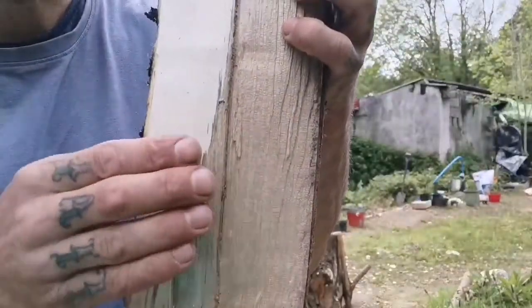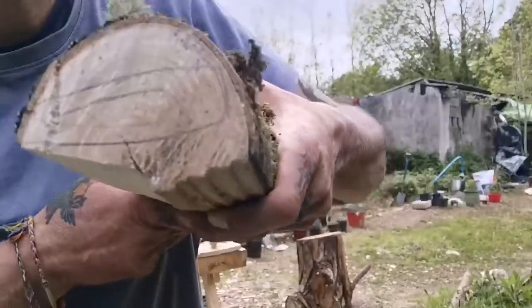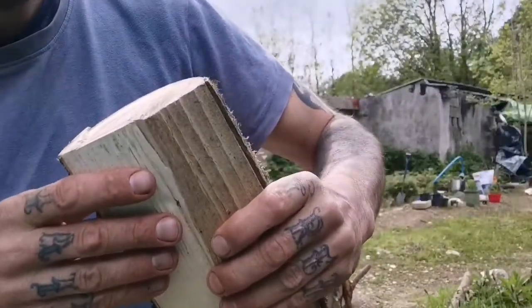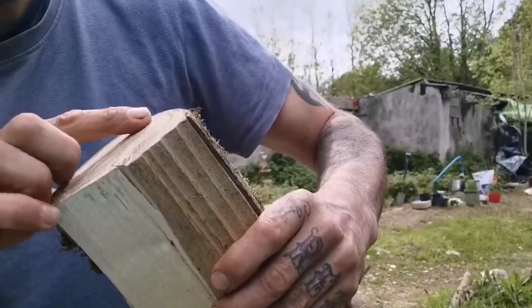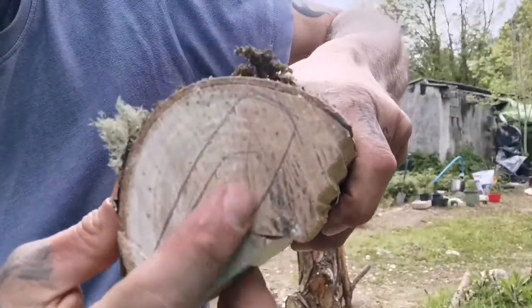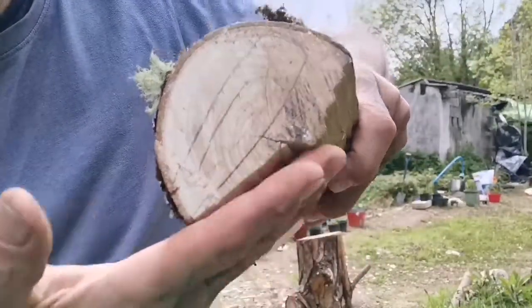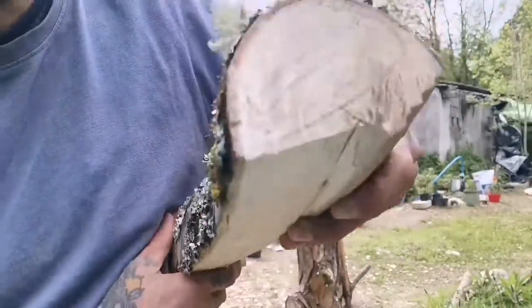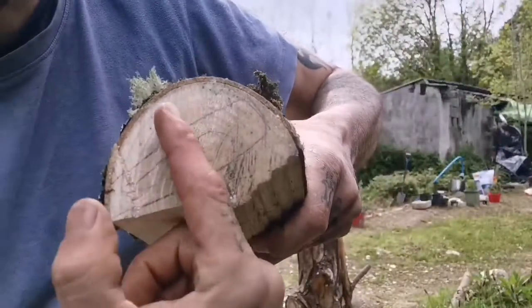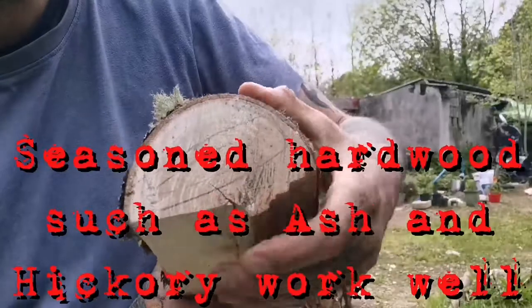See, so as it's flaking, you want your axe head to point that way with the grain. So if you look on the top, you can see it in different directions on here, but that's mainly off where it's been cut with the saw. But there's some lines on there, you see how the circles are kind of going that way. That's your grain running that way generally, so that's the general line. If you were to have your axe head going that way instead, then your wood would more likely split when you hit it with power.